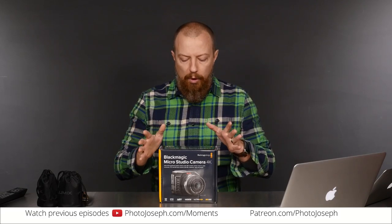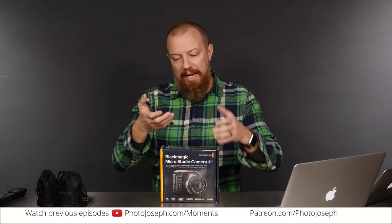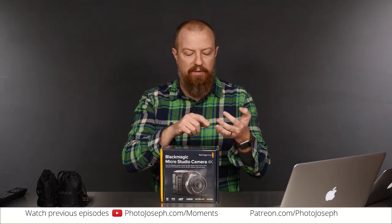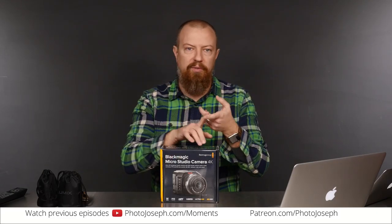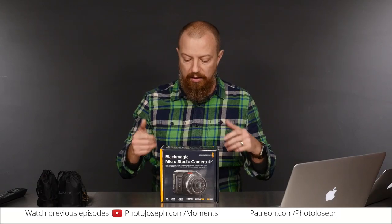So what is this thing? It's a camera, but it's specifically for shooting video and primarily designed for live production — exactly what we're doing here. On any normal camera — mirrorless, DSLR, whatever — you've got a series of parts: a lens, a sensor, some type of recording media like a micro SD or CF card, and a viewfinder or LCD. This device removes the viewfinder, the LCD, and the recording media. It's essentially just a sensor for you to attach a lens to. It has controls designed to be controlled remotely, which is where this gets really, really interesting for live production.